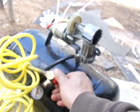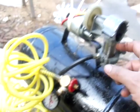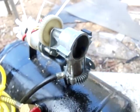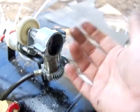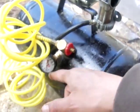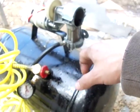Now I'm going to shut this valve completely off. To fill up the whole tank would probably take you about an hour with this little compressor. It's a good workout too. These can go up to 175 PSI because they have a very small piston. Now it's going to take forever to get something to 175 PSI. If I hooked this to 12 volts, it would probably take about 35 to 40 minutes to fill this volume of tank up.